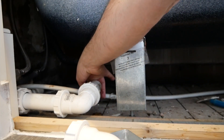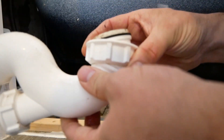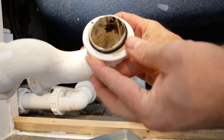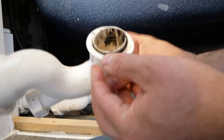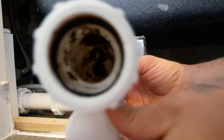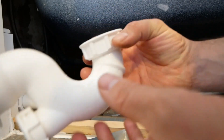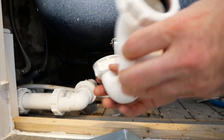And that's the pipe — there's nothing in that pipe either. So I'll stick this back on. Now, you can see in there there's a wee rubber — see that? There's a rubber there. You've got to make sure that's located nice and flat onto your bath waste. Otherwise you will leak. These are quite difficult to get back on without leaking, so just take your time, screw on the right thread, and it'll be fine.